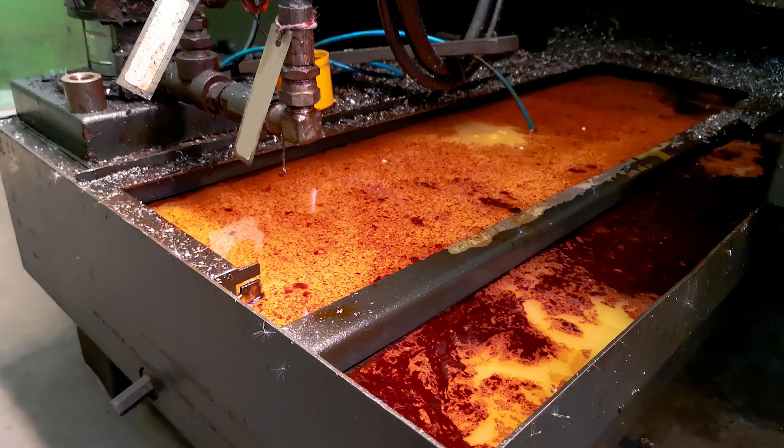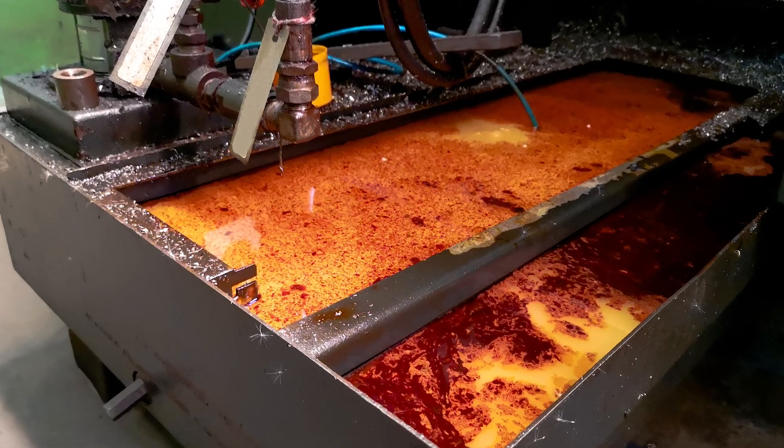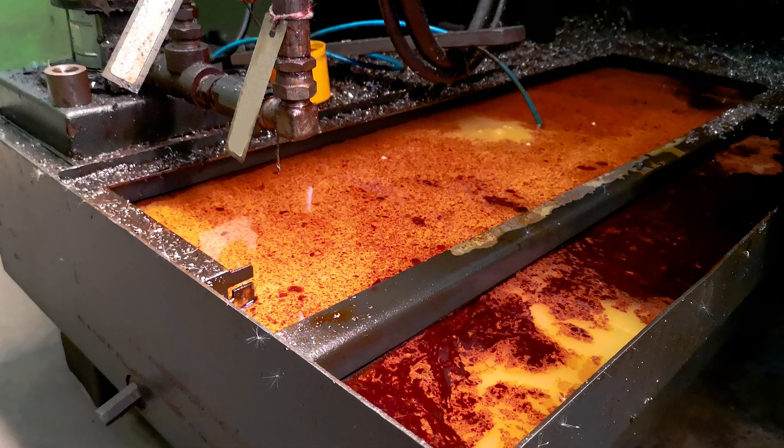Sometimes you have tramp oil and you don't clean it off — that big black scummy layer that forms on top of your sump. We've all seen that. It should get cleaned off on a regular basis. If we don't, it gets mixed into your coolant and then it's all over your skin, and that oil can sometimes cause dermatitis or irritation.